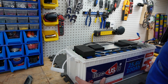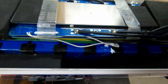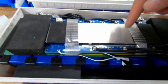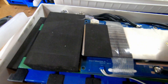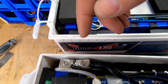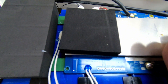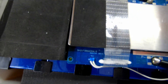We can see these are very similar. I put tape on the 12 volt battery after reassembly just because I removed the BMS from its shipping straps — not original tape. You can see everything looks the same: here are the balance lead cables. We have two sets of balance leads because it's a 24 volt pack instead of 12 volt. We also have a high temperature sensor on both. The BMS model numbers on each unit appear identical.